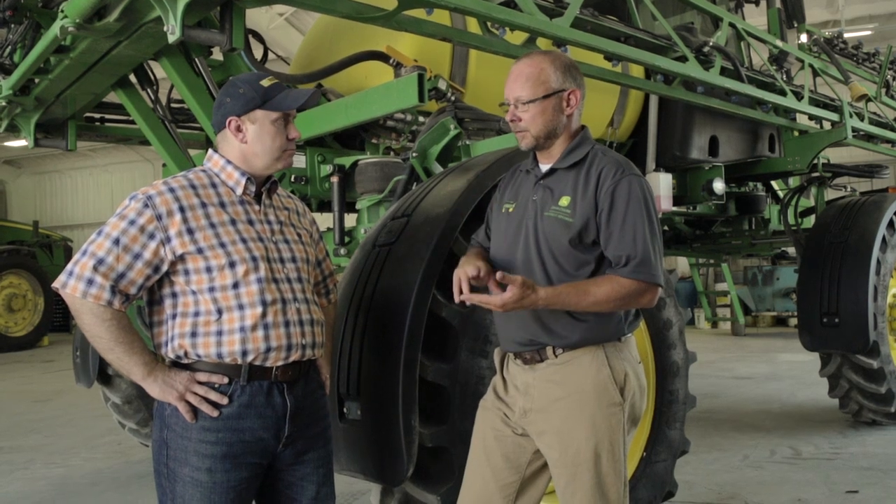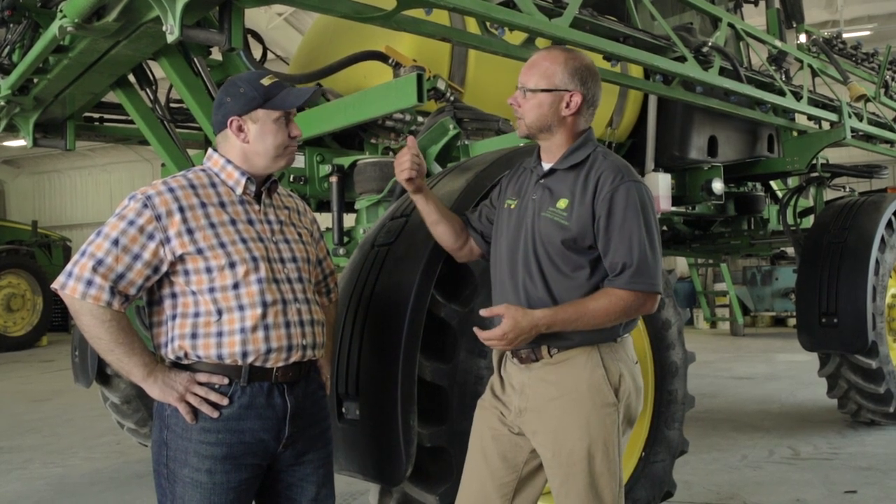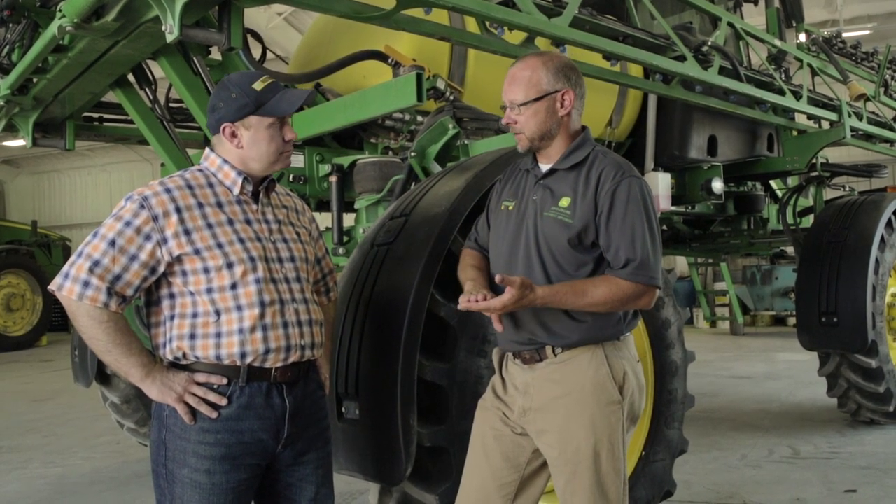Jamie, thanks for having us out here. It's my pleasure. Tell us, why is it so important for growers to properly calibrate their equipment, and what are they risking if they don't? Well, I want an even application coming out of the sprayer, and there's a lot of things that come into that. There's calibrations of ground speed, radar if we've got radar, flow meter calibration, and we'll check nozzle flow. Some things we can do ahead of season to ensure that we have an even application across the boom at different varying speeds.